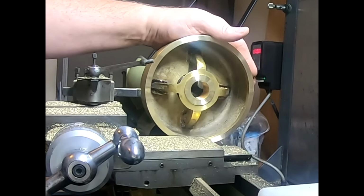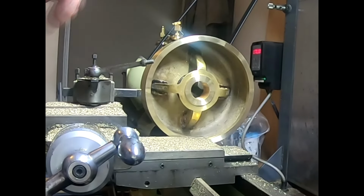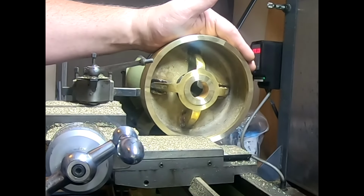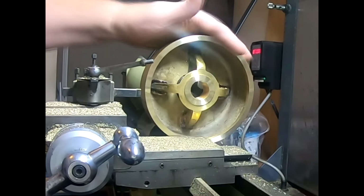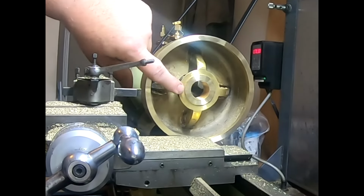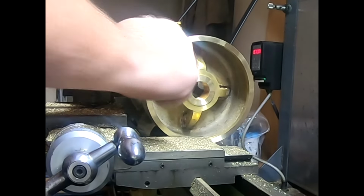There's a bit happened since the last bit of video I shot. So let's have a look and just decide where we're going here with this. Yeah, put a boring bar in, and bore this face to match this one so they're nice and parallel. And then bore this one out next.